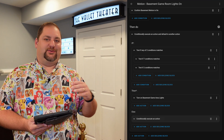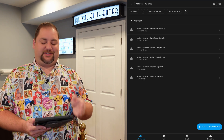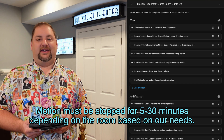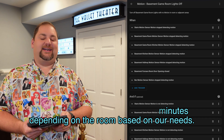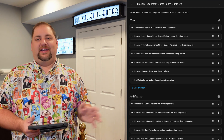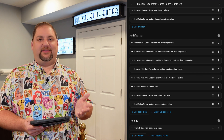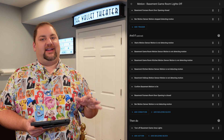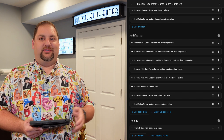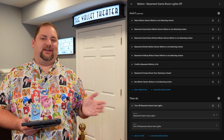You can choose your own adventure — implement it as deeply as we have or use a more basic automation for lights based on motion. Next I'll look at the other automation for the basement game room: turning those lights off. It looks to see if there's motion in any adjacent rooms, or if the furnace room door has been closed. If we're in the furnace room — a closet right behind the camera — we want to make sure lights stay on out here so we don't come out into the dark. It keeps things well lit if that room's open. Then it checks that all conditions are met — not just one trigger spot — we want motion to stop everywhere, the furnace door to be closed, and the basement motion toggle to be on. If all that's true, it turns the lights off. It's a simpler off-automation compared to the on, but it does exactly what we want.